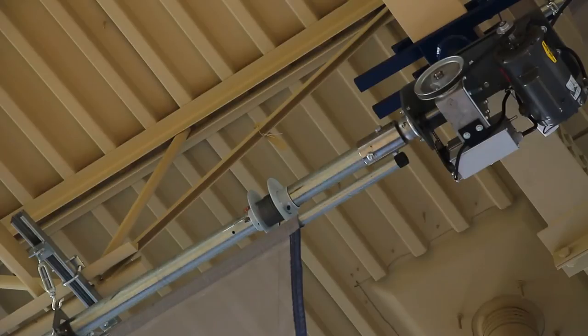Additionally, a line shaft safety lock may be specified on each curtain as a safety mechanism. This safety device automatically locks the line shaft if the lowering speed surpasses a safe velocity.